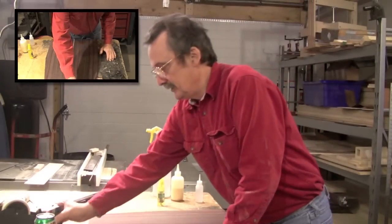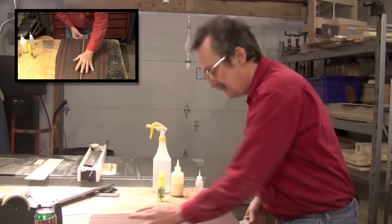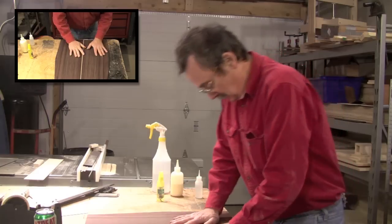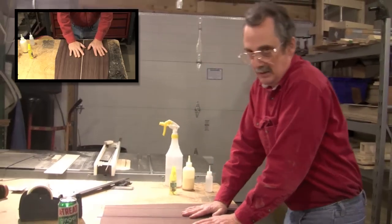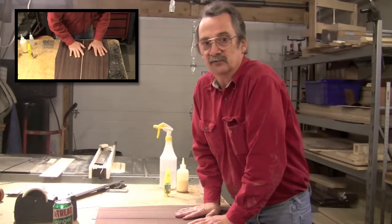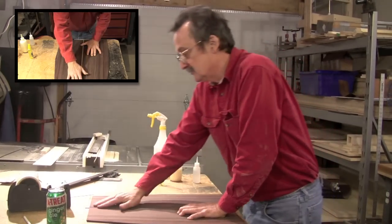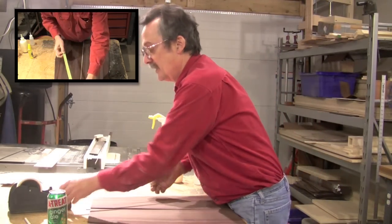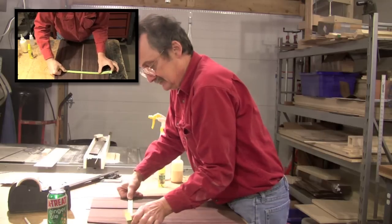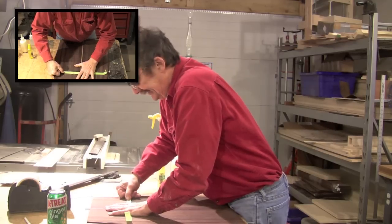Here's another quick tip — there are a lot of ways to glue tops and backs together. With rosewood you can use super glue, but I would not recommend using super glue on any porous wood like mahogany or walnut. I've seen this trick used many times and I've used it myself. What I like about it is I can put things together and I'm building in no time.